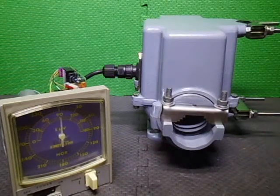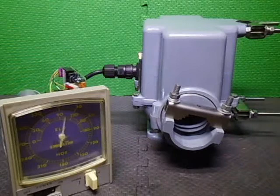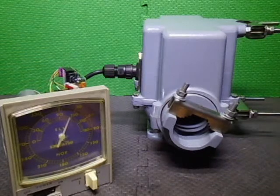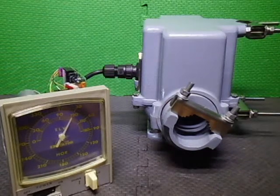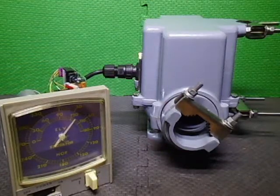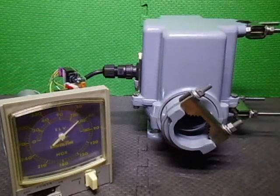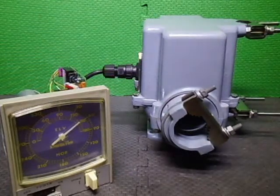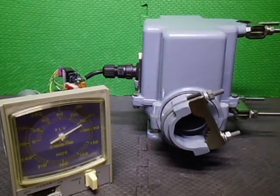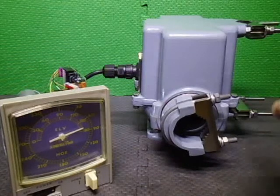And if you're timing this, you'd see that it's going to be about 95 seconds for 180 degrees, plus a little bit extra for the extra rotation we go. So, slow as a wet week, but it's something you don't want to be spinning around too fast, especially with the bigger aerials. I think this buyer's going to be using some 6 meter stuff on this, so it's going to be out there. I think they're going to be horizontally polarized, if I'm not mistaken. He wants to put a pipe straight through, and he's going to put bearings on the actual shafts out the side, and he's going to guide off to keep the bend out of the cross boom. Novel idea, but we can do that because we can put the pipe straight through.